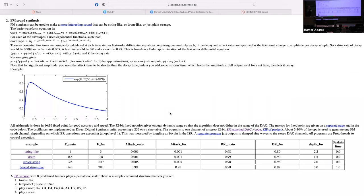You could literally make these into knobs on a synthesizer and change all parameters in real time. The sound you get out of an FM synthesizer as you turn these knobs is really hard to predict, which makes it deeply addicting to play with. If you're building synthesizers, you might consider having an FM synthesis mode where the user can play with these parameters via potentiometers or some other interface and just hear what comes out.